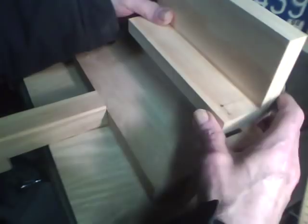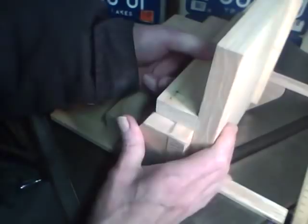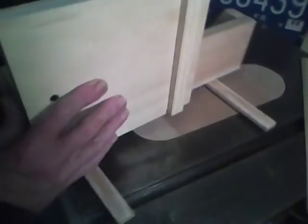Okay, once you get that nail in there, or that pin, then you slide it over all the way, and you run a small kerf right here. And then you take your square, put it up to the left of that kerf, and you glue this fence on. Okay. That is really the only critical part, though, is the width of this pin.